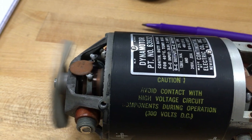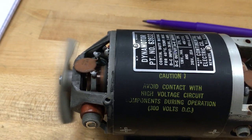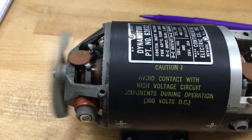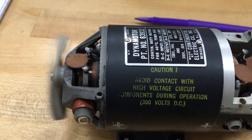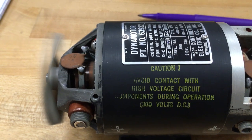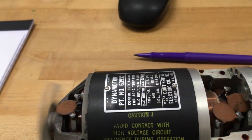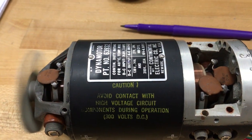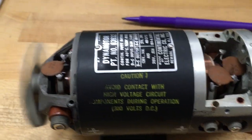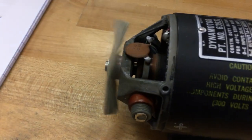If we were to have more torque on the rotor from the current running through it than the resisting torque, then we'd expect the thing to accelerate — and that's what happens when starting up from a motionless rotor. If the resisting torque was larger, we'd expect it to slow down. So, if a rotor goes into a stall — I'm not going to do this with my finger because that's a metal fan blade moving fast, but I'm going to stick a pen in there. I'll turn it down to, like, four and a half volts so it's still whirring along. The amperage is still right around half an amp. There's our little whirring fan blade.